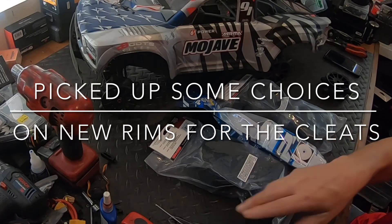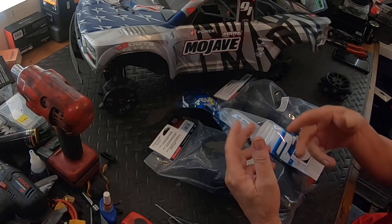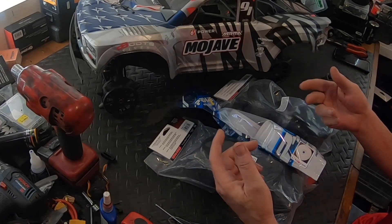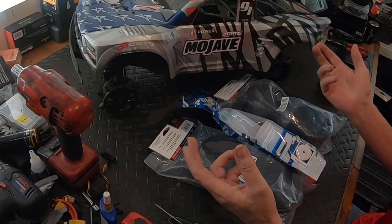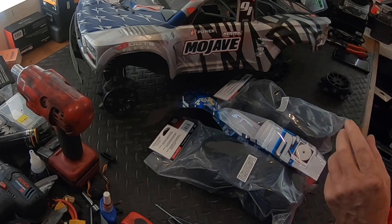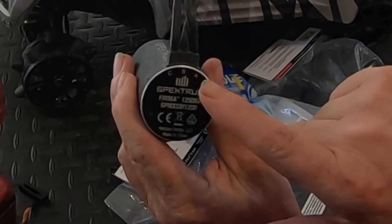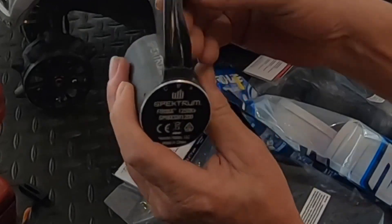I've spent the last few hours running from hobby store to hobby store. Had a couple of fails today with the Mojave. You guys saw everything I did in the last video — I hooked Castle Link up, we calibrated the motor, I finished everything up, put it together and I mentioned I should probably check motor direction. I figured the ESC was already set up, there was already a motor in there, it should go the right direction. Now you do have to line up A, B, and C, and what I've noticed between Spektrum and Castle is Castle starts with A B C while Spektrum starts with C B A. Shouldn't really matter because regardless they're in order, but I have one wire that's crossed over.